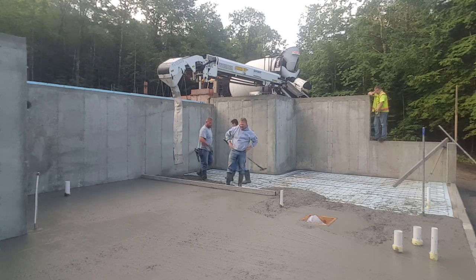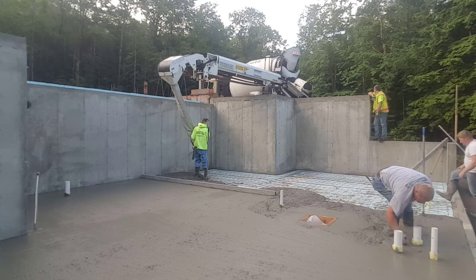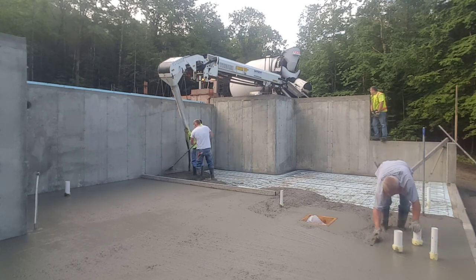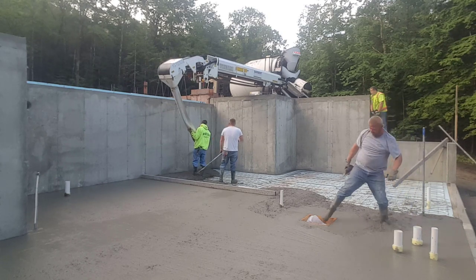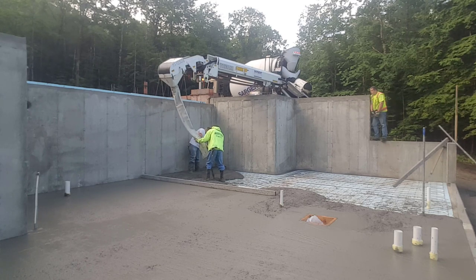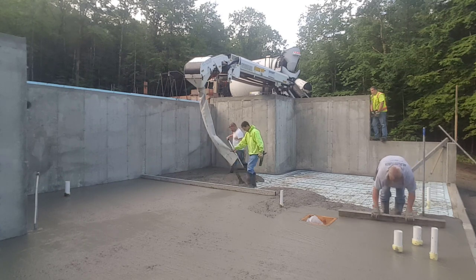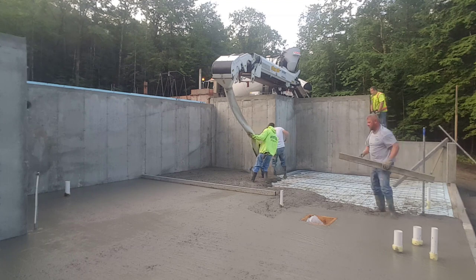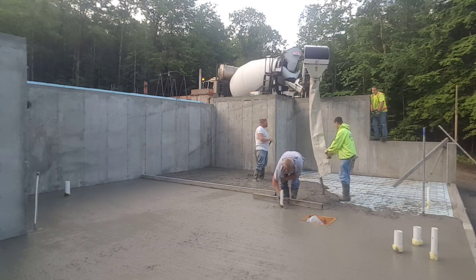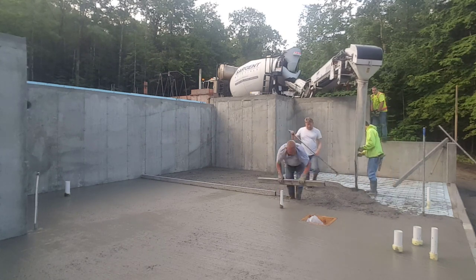You can see how we kick and pull back, kick and pull back — we just keep going. We're going to give that a quick mix and then pour the rest of this out. Two of us will pour a little more concrete, then that other guy will get a small straight edge and finish off around that box — that box is probably for a shower. You can see how easy that boot makes it from the conveyor to put the concrete right where you need it. We pour these floors every day, sometimes two a day, so we don't want to be killing ourselves pulling concrete any more than we have to. That boot has about a six-foot radius — I can push and pull it back so it covers a lot of ground.